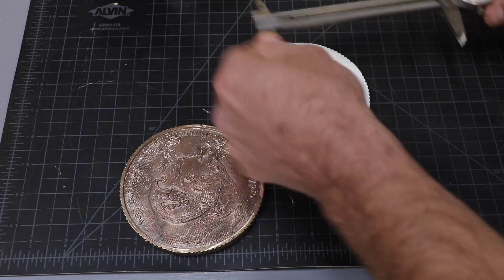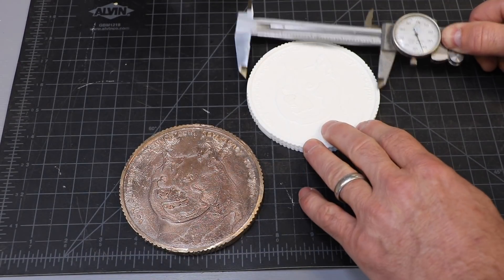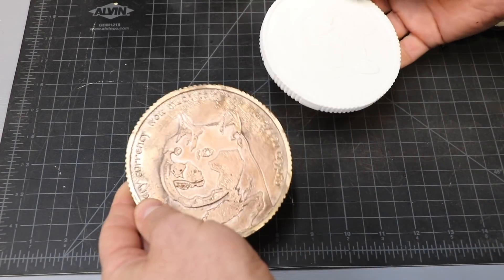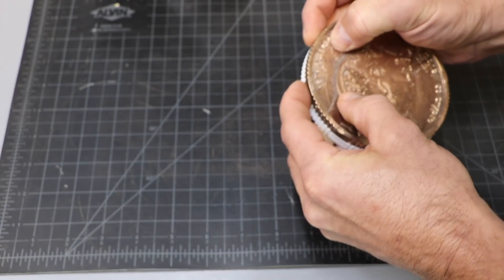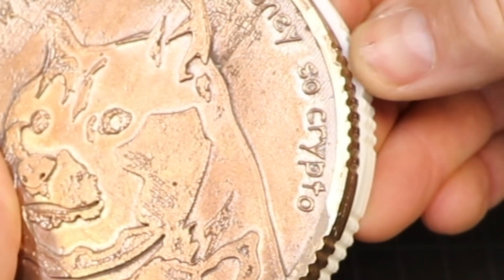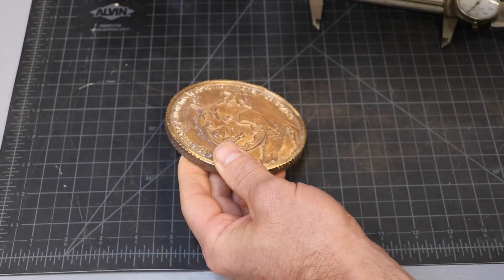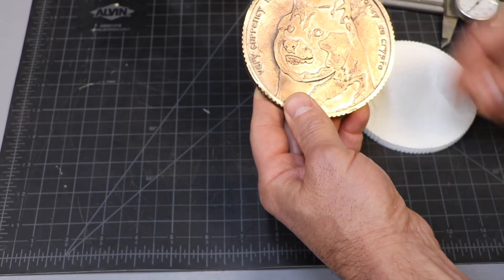I've been doing some measuring. When I compare the diameter of my pattern — 4.254 inches — and then I take this coin, it ranges from 4.2 to 4.21, and that difference is about 50 thousandths. I'm going to line these up exactly so I have them flush on one side, and you can see I'm now sticking out over here even though I'm flush over here. That is basically the metal shrinking as it goes from the size it was when poured molten, and then when it becomes solid it's 50 thousandths smaller.